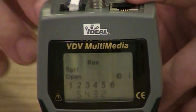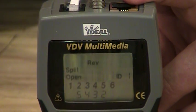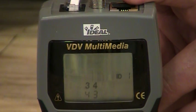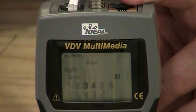And when you look at typical telephone patch cords like this, old analog phones required that those wires be reverse wired like this in order for it to work properly. New digital phones don't care about it. They're not really polarity sensitive, so the tester here actually shows this as an error, but if I was looking for that in an old phone cord, this would be fine.